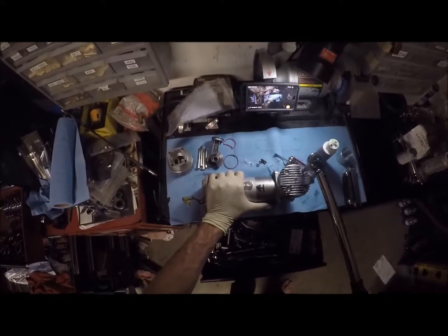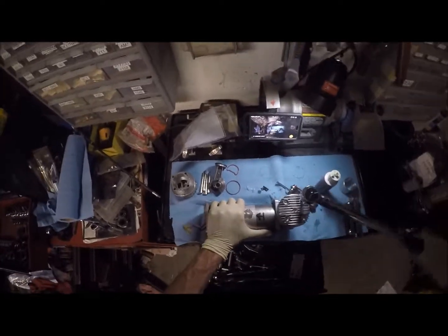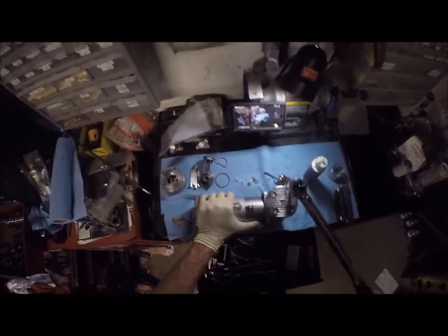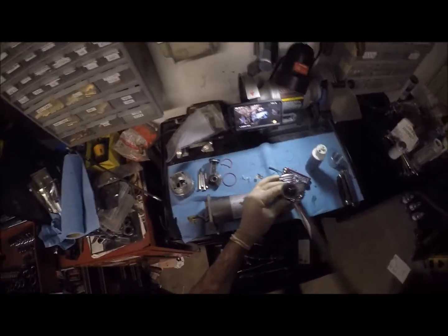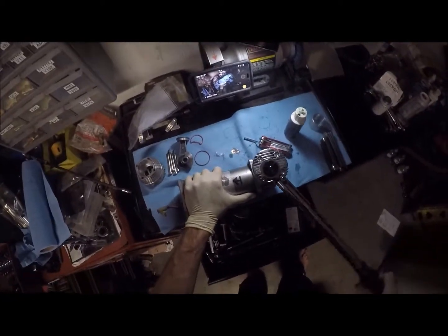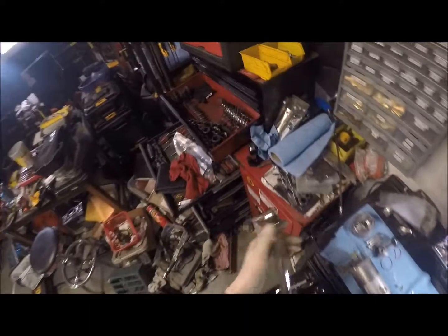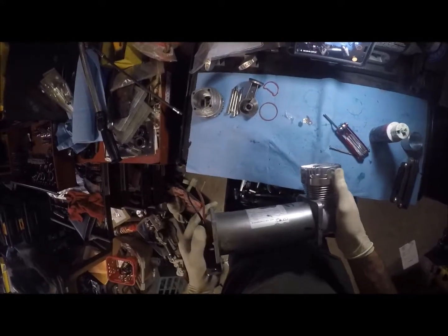And the reason I'm torquing is actually because it's even pressure. If you do it by hand, you may get close, but it's not even. Whereas when you torque, it's even tension across all 4 bolts. So the bottom ones don't matter, but the head does. Okay, so there's 15. All right, and that is a compressor rebuild on these.